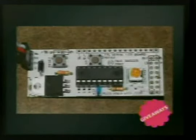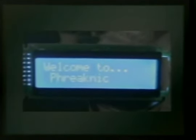Here's an example. There's like a 5-minute demo on this guy's site, Modern Device, of the LCDs just doing stuff. But we're going to set up our serial. We're using software serial so we can still have it communicate to the computer. We're having a different serial connection going on. We're going to set all that up, and then we're going to go through this loop where it clears the LCD, it delays for a second, it moves the cursor to line 0, it says print some stuff, which looks like that. And if you try to do that straight wiring without any sort of controlling thing, that is an awful lot of little dots that you have to light up, and that took one wire of actual data. So that's really easy to do.